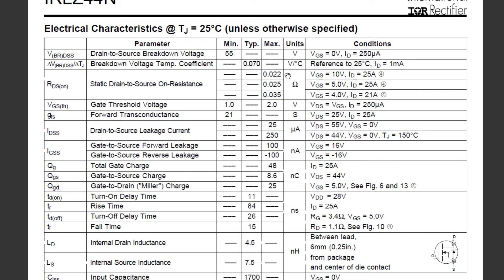When using a MOSFET as a switch, you want to be in two states — either totally on or totally off — and switch between them as fast as possible. You don't want to linger between the two states or your power dissipation will increase. You also want to bring your drain-to-source on resistance down as low as possible if you're driving a very heavy load. But if you're just driving relays, LEDs, a motor, or a contactor with an Arduino Nano, 5 volts is no problem. If you're driving a very heavy load and switching it very fast, you want to drive the gate with a higher voltage and maybe use a MOSFET driver to charge and discharge the gate capacitance very quickly.